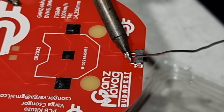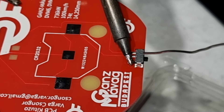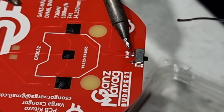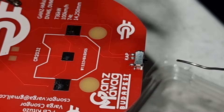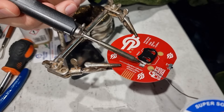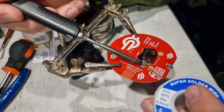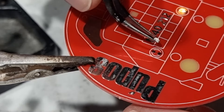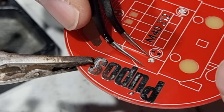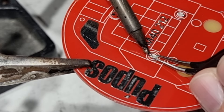It's a little fiddly to solder. I purchased SMD switches from AliExpress — on the back side they have a small dimple for locating on the PCB, and the PCB footprint has small holes so it sits in the right place. For the LEDs, I tinned one pad first, then heated that pad, slid in the LED with tweezers, let it cool, and soldered the other side. All of them worked — it wasn't as difficult as I initially thought.